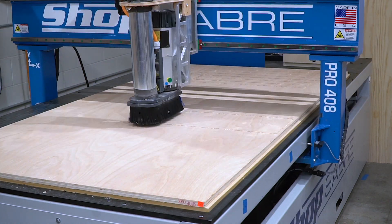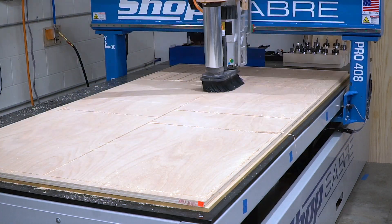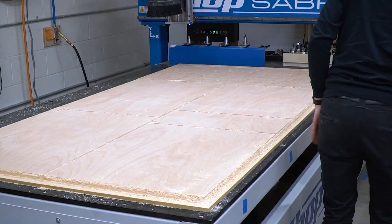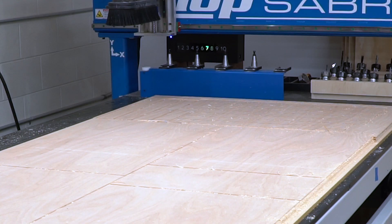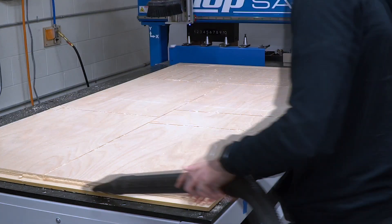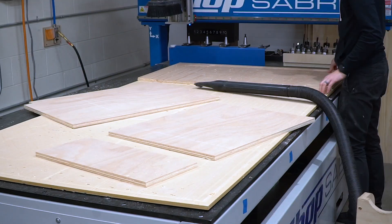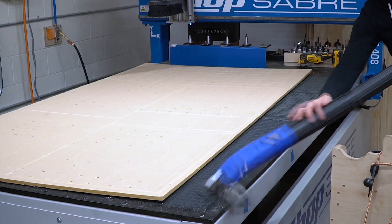Big plywood parts, like the front of the machine here, you won't have any problems with hold-down with our setup. But in the back, those little parts are tabs. Just to illustrate this point, watch as I turn off the vacuum hold — and you can see it drop pretty precipitously up there. The idea is that eventually we'll be able to watch this gauge and know whether or not we're going to lose parts by calibrating it to what we know is a problematic pressure drop.